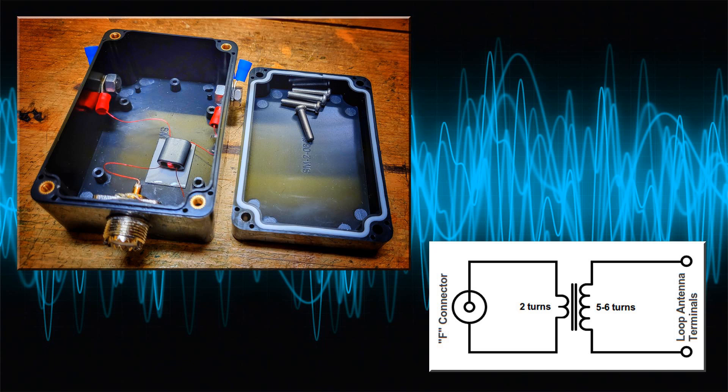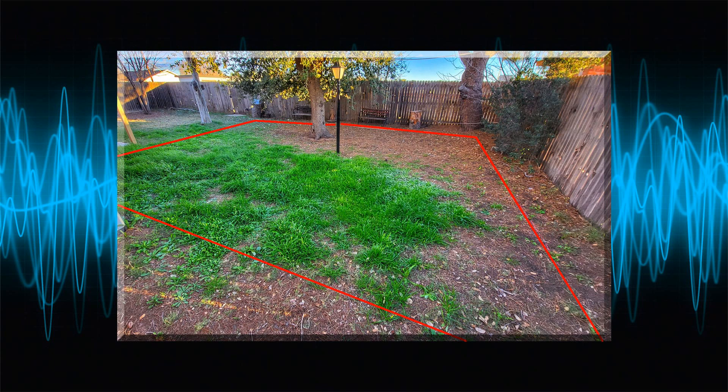If you're on a noisy night receiving DX from your main lobes, you're going to think this is the greatest antenna in the world. There will be other nights where it just makes everything a little quieter, including the signal — so it's not a perfect antenna. That's why I mainly use mine from 40 meters down, since those tend to be the noisiest bands in summertime. Here's my backyard — there's winter grass growing over it. The antenna runs 30 by 25 by 30 by 25, with the feed point in the bottom right corner.